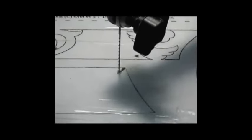Now at this point, I'll turn the work so the blade is on the line and I can take off in the new direction. Keeping the proper amount of left deflection in, I'll slowly start while coming off the line until I get a feel for the deflection required. I don't want to overshoot the line or wander off.